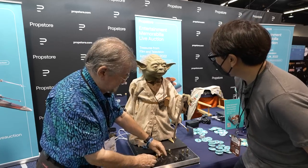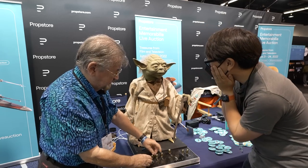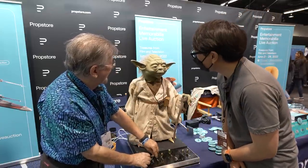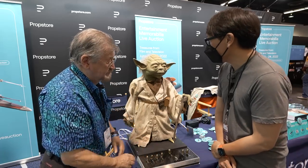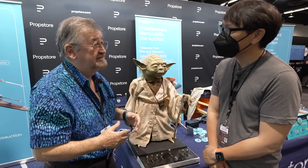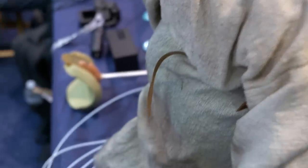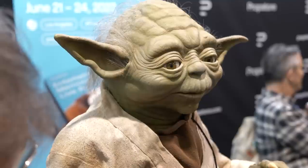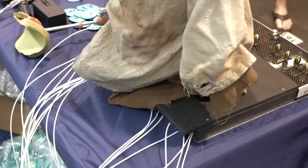You can get movement of the ears going up and down, but you can also control that from the bottom by pushing it up or pulling it down. So by controlling the two together, you can push the ears out or pull them in, or take them up or take them down in a very expressive fashion. People today talk about animatronics and they instantly think of radio control — but Yoda had no radio control at all. We were makeup artists, not engineers. We approached it from the principle of what was organic, what would give us a soft, believable movement — which I think we achieve with the ears and also with the eyes.